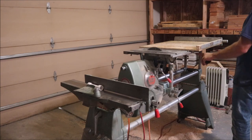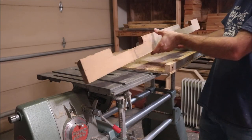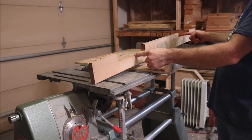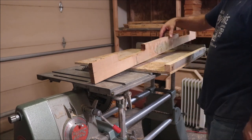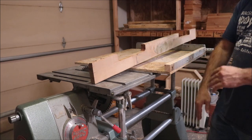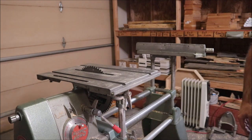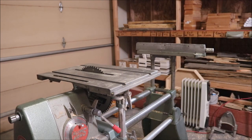And we'll have the two runners on the bottom side. So I think I'm gonna use something like this. And I'm just gonna cut 24 inches out of it, and then I'll joint this backside, and then we can use that to go across here, and then we can cut things up to 3 inches. So we're gonna run this through the joiner to get that end smooth. Actually, let's cut the 24 inches out because we're already set up for that.